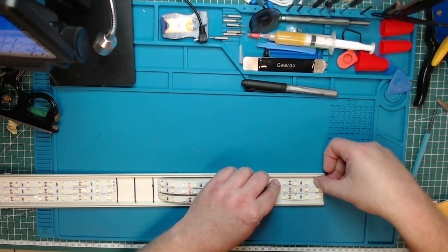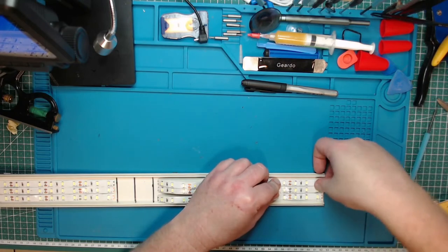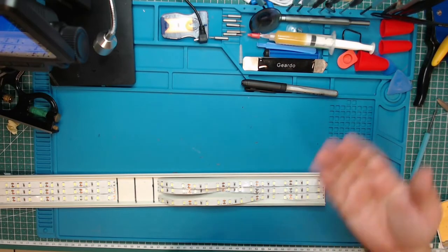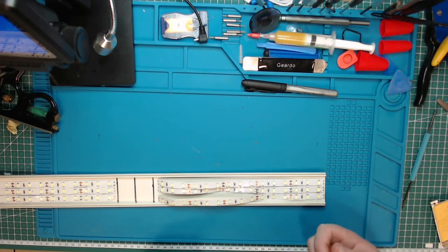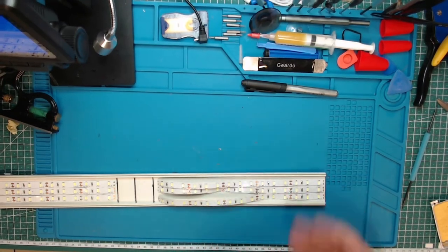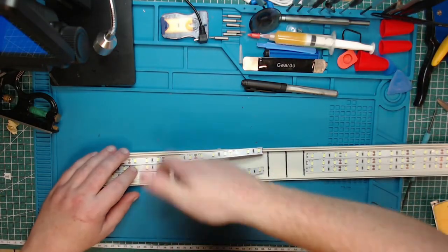So it does stay hot a little bit longer. The downside is that it starts hotter. So if you're ever working with stuff like foam, you've got to be very careful. And I generally like to plug it in for a bit, let the glue melt, let the tip get hot, and then unplug it again. In that way, you're sort of working in this plastic window where it's still liquid, but it's not at full temperature. But anyway, I digress. I'm just going to flip this around because it was a bit easier, me being right-handed, to do it this way.